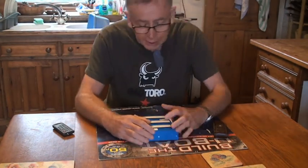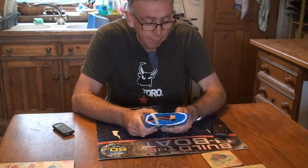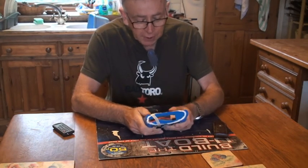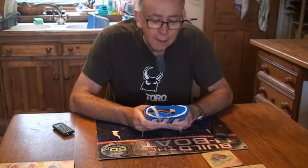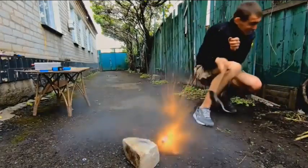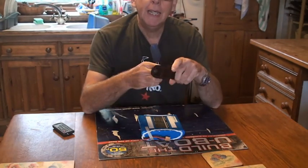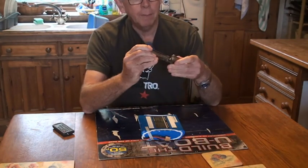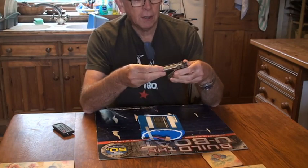So what I'm going to do today — this battery is defective. It's brand new old stock but it's defective because it's been stored for too long. The task is we've got to take this thing completely apart. These batteries are dangerous; if you short them out it's not going to be good for you or anything else for that matter. I can't stress that enough. I'm using a sharp knife to go through the shrink wrap, but the knife is more than capable of digging into the batteries themselves, and if I were to short out a cell or a number of cells I'm going to get a very large bang. We have to be very careful here.